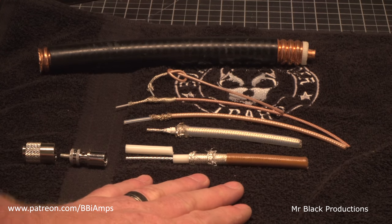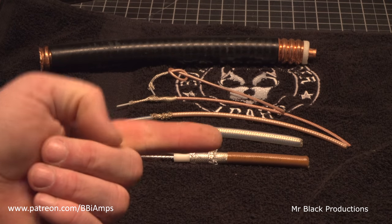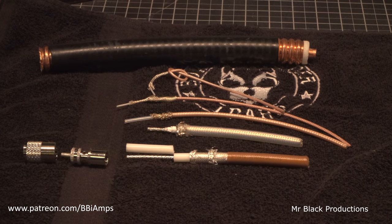RG393 is a fine example of high power handling capability and very resistant to breakdown. In my world and a lot of the people around me, we would rather have coax that can handle a lot of power, put up with a ton of heat and a lot of abuse, versus sitting around worried about if it's going to have 0.001% loss over 100 feet.